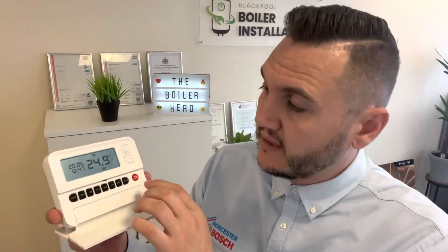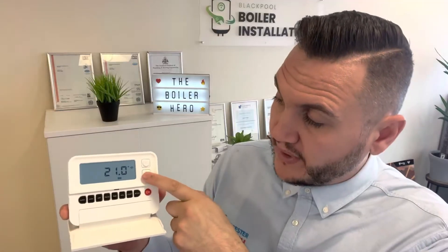On the main screen, if I press okay it brings a little light on — it does go off just to save batteries. If I press manual control it says 'man' just there. The current temperature is 25 degrees, so pretty warm in here. If we want the heating on or off, all we do is turn that up to whatever temperature we choose. Let's say I want it set at 20 — I'll take it to 20. It's flashing just to communicate with the boiler. Now it knows we want 20 degrees. Obviously the heating won't come on because it's already 25 and we've asked for 20. As soon as the temperature drops to 20 the boiler will kick in and keep you at 20, and your house will stay at 20 or above unless you decide to turn it up or down.